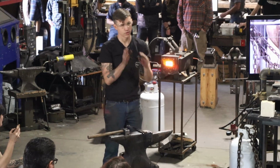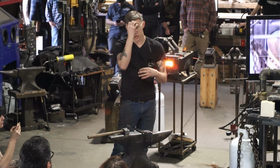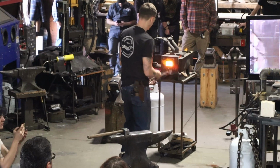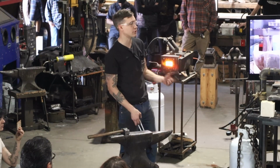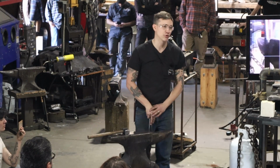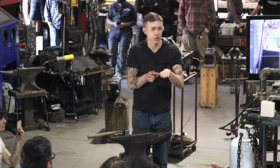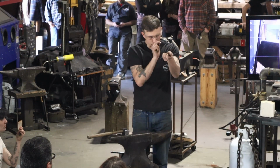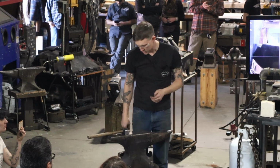And then, once I get this blade about where we want it, I'm going to show you how easy it is and how quick it is to transform it into a totally different kind of knife. Now, big question, do you forge your bevels in or not? Good question, right? So it's really nice on a stock removal knife to be able to lay it on a piece of granite or a flat surface and scribe the center line on your cutting edge. So you can have just a perfect line down the middle, line of sight, cutting edge very straight, scribe it, maybe flip it, scribe it on both sides.